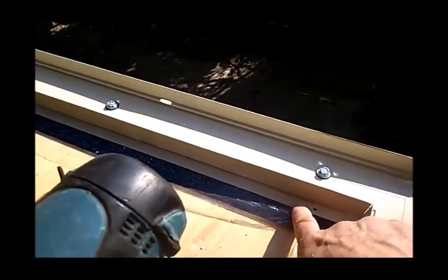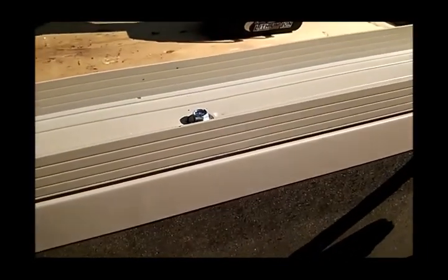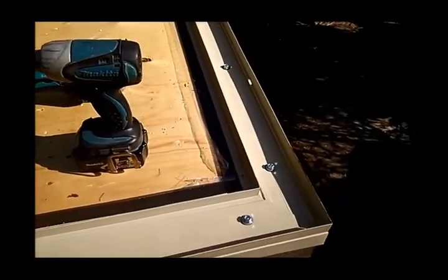Completely on the flashing, comes slightly inside the room. The flashing is bent about 2 inches down the face. When the job is done, we'll slip a flashing up behind that to completely trim off the face of the deck. Track is all properly screwed. Those screws will all get covered with silicone.